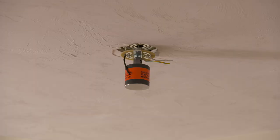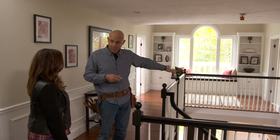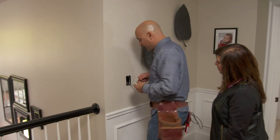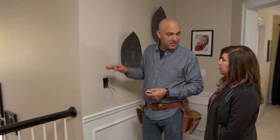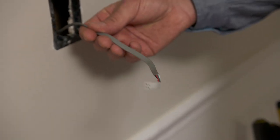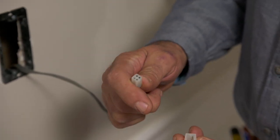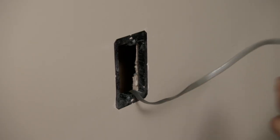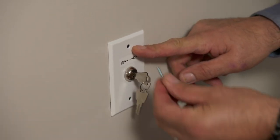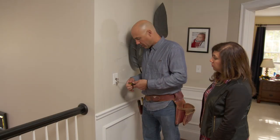You see that orange weight right there — that gets removed and the light fixture gets hung from that bracket, but we can lower that and do it all from down below. Now we need to control the up and down movement. This is a great spot for the key switch for two reasons: first, we can see the light fixture — you've got to be able to see it from where you're controlling it; second, it's out of the way. I've fished this low voltage wire down to the wall. It connects up top and has this push connection — it only goes in one way. The low voltage ring doesn't have a back, so you just do that and put the two screws in.